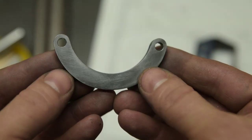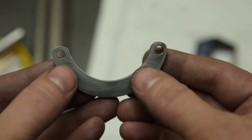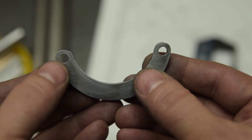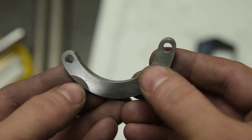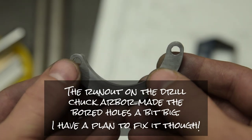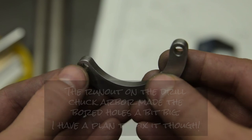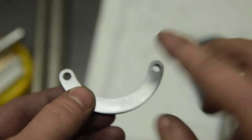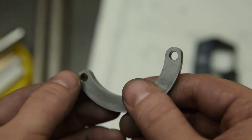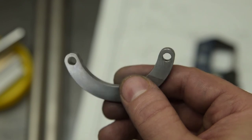I guess I'll do the pins next. And they're going to be as with the drawing, except I'm going to make two changes. One is that the diameter is going to suit these holes that we've accidentally made oversize. And the other thing is I'm going to increase the length by the radius, which is 2.5 mil, and put a hemisphere dome on the end of the screw, because I quite like that feature on handmade stuff.